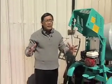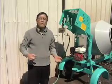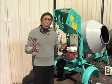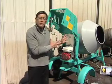It's a misnomer to think that, even though the capacity of a countertop might not be that big, that you just mix it out of a wheelbarrow. I really recommend getting a professional mixer. You can rent one at your local rental yard, and they have varying capacities depending on your need. But whether you're an amateur or a professional, I always recommend getting a cement mixer for making concrete countertops.